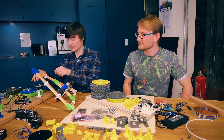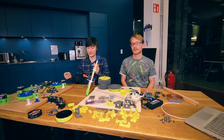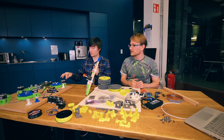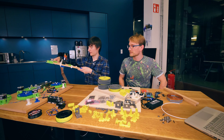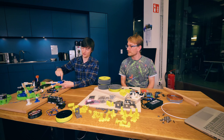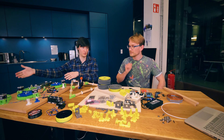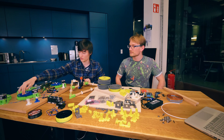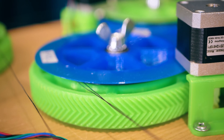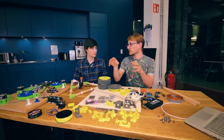There are three parts that need to be accurately placed: the white line rollers for the D lines — the ones that come straight down from the ceiling to the mover. The way to place them out is by building the mover first, then laying the mover on the ceiling plate and marking where the holes are, rotating them so the line can enter from the D spool. The rest of the work is making sure lines don't cross each other or touch gears. Pictures of the units will be up on the website so you can have a reference of how stuff is laid out.